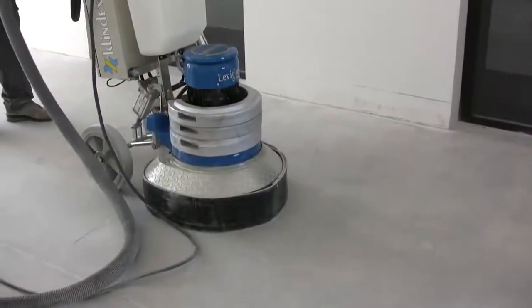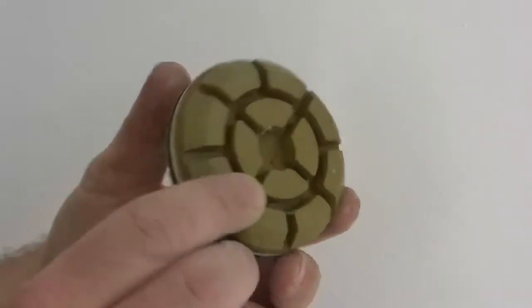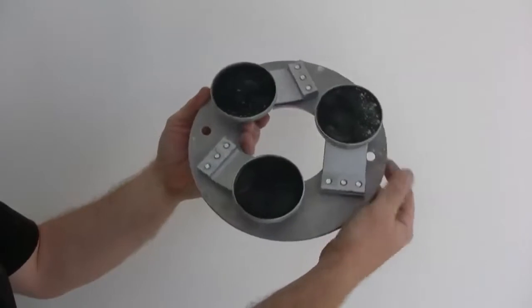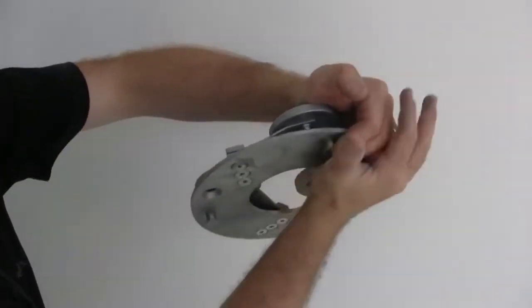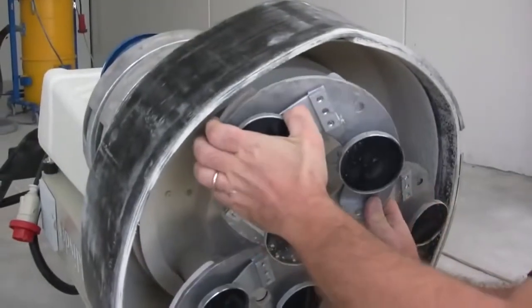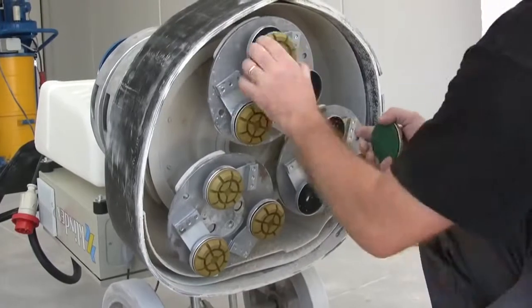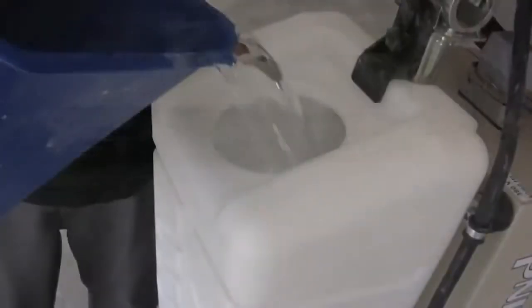After the passage with CS2 diamond abrasives, you will proceed with CK3 resinoid abrasives. We suggest the spring holder system as an essential accessory for polishing. Thanks to their clever design, its supports allow to obtain a uniform polishing. The diamond abrasives are pushed through supports equipped with springs even in the slight depressions and waves in the ground, so that all the surface is perfectly smooth and polished.